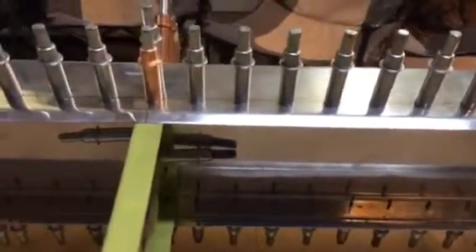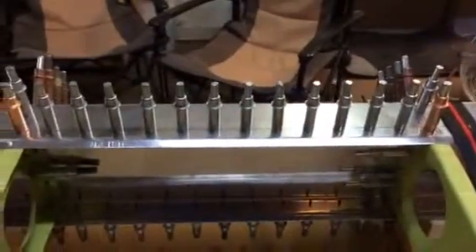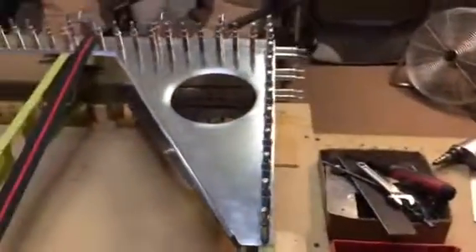The gussets are all in place, everything's riveted or cleco'd in. One thing I am concerned about — you can't really see it — but I didn't think about the edge distance of the hole I drilled here, not to the edge but to the vertical portion of the spar web. I'm hoping I can get my dimple die in there without having to grind it too much. If not, I'll button-head rivet the whole thing, because I know one thing for sure: I'm not making another left flap.